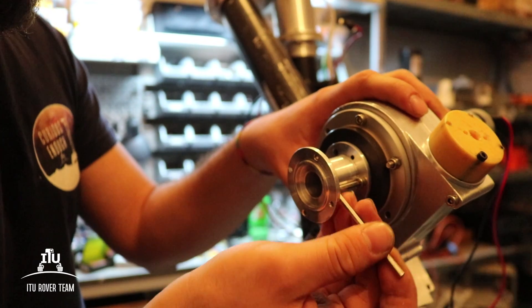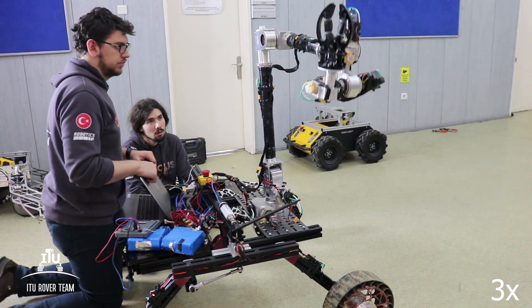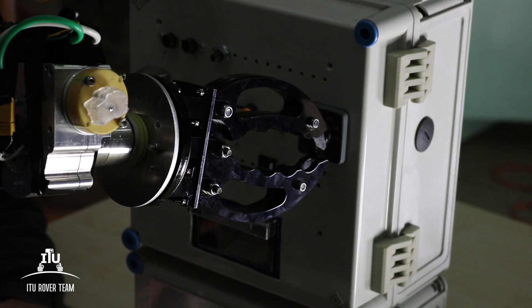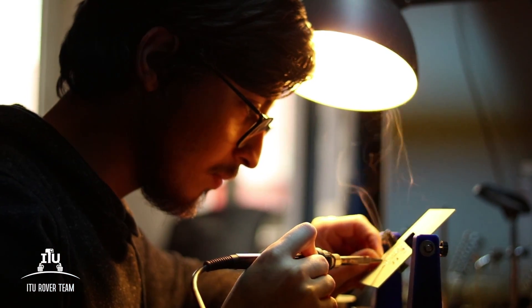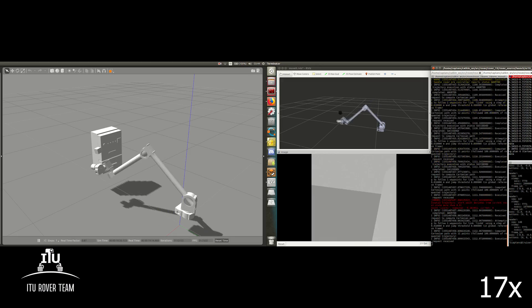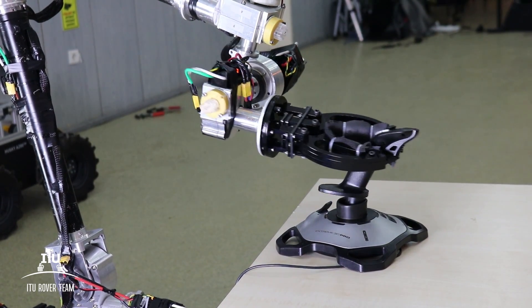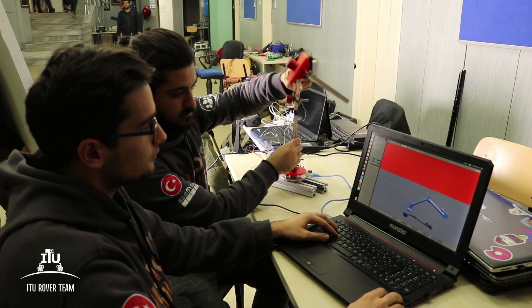Each axis is controlled by a brushed DC motor and an encoder connected to the worm shaft, thereby bypassing gearbox backlash. With the self-locking of the worm gear mechanism, the arm can store the last position information for further use. In each axis, encoders are connected to individual motor drivers for local closed-loop position control. Only a power line and a CAN bus network run along the arm. We use a user-friendly robotic arm control software called MoveIt; the end effector or gripper can follow a trajectory using Inverse Kinematics, while Forward Kinematics serves as a backup plan. Every command can also be sent to each axis separately, and a small robotic arm model mimics movements to give the user better intuition.